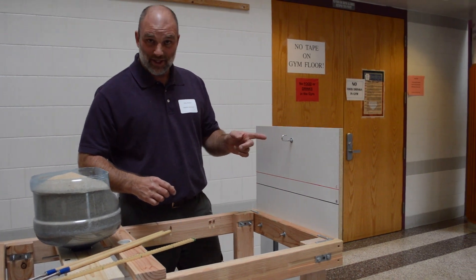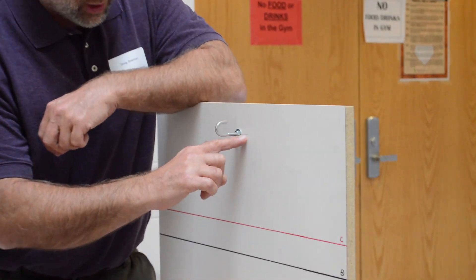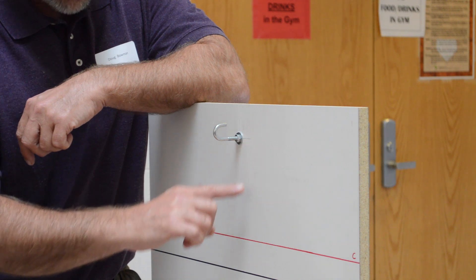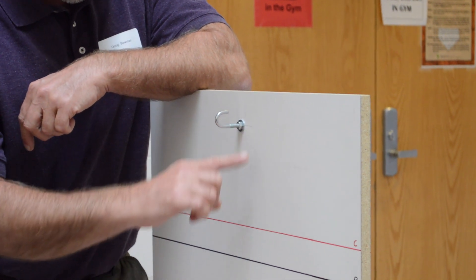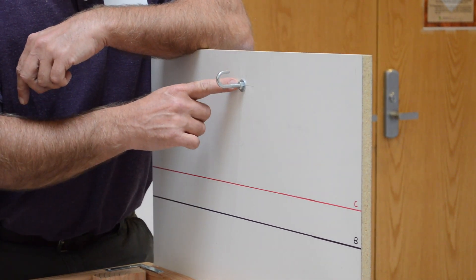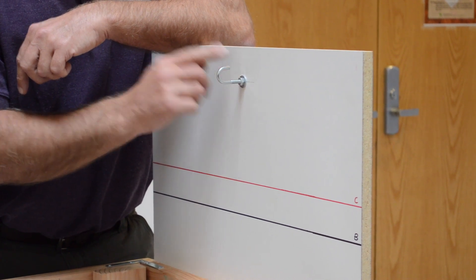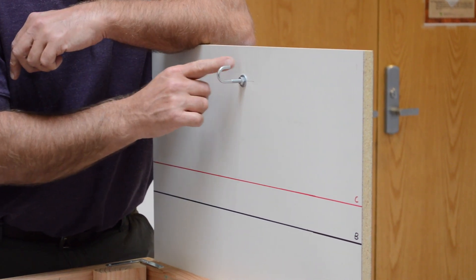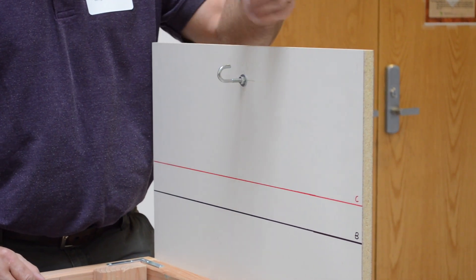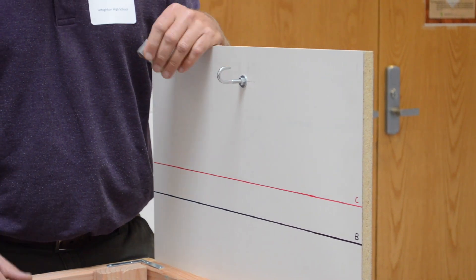Let's talk about the hook — I want to zoom in here. The center line of the bolt is the definition. The distance below that to the red line is 15 centimeters. From that line to the middle school line is 20 centimeters. This top part of the hook needs to be 2.5 centimeters plus or minus one millimeter from the wall. I use a block that I've measured — if that fits in there, it is 2.5 centimeters. That's an easy way to measure that.